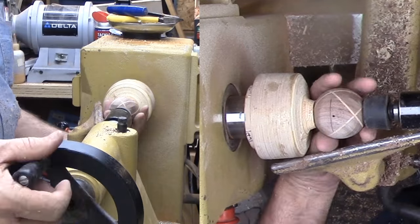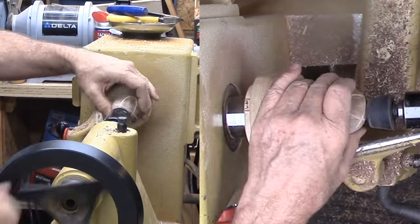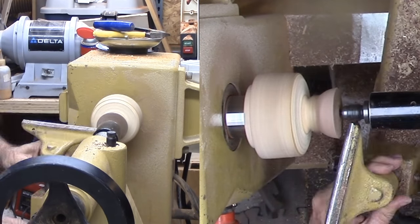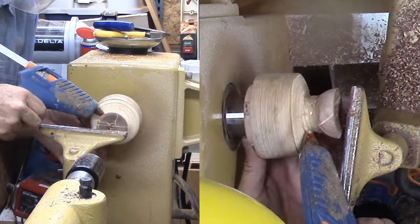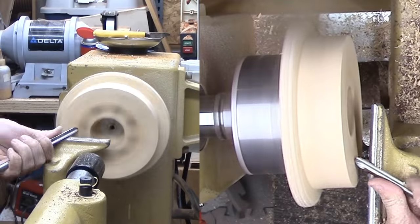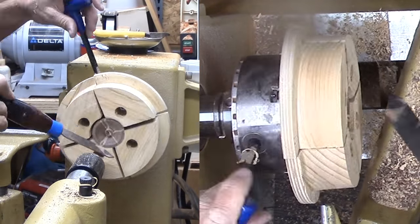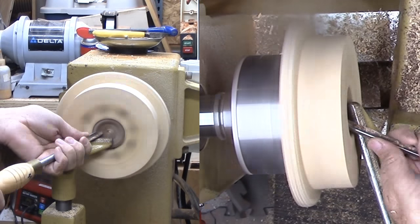Finally, instead of marking a new diameter, I parted the sphere in half. I wanted to hollow it to make it lighter for hanging on a tree. Now the hard part — how to hollow a hemisphere. I tried to hot melt glue one half to a faceplate, but after a few cuts it was obvious it was not going to work — it was working loose. Then I remembered my wooden chuck jaws. After mounting the jaws, I took a couple of cuts to make the jaws uniform, then cut a groove on the inside of the jaws. This was perfect for holding the edge of the hemisphere, so I can quickly hollow both hemispheres as if they were tiny bowls.